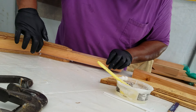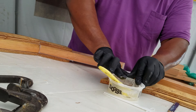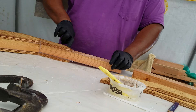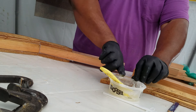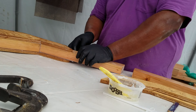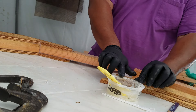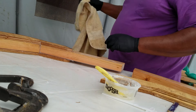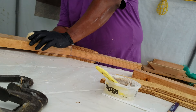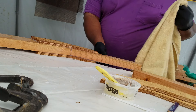It's a pretty good day here. Put a little bead in the middle — that's an important place to keep water out. Looks good. Can't touch the camera to show you the backside yet. Put an initial wipe, get all the epoxy off, then I'll take a towel and wipe it down, because I don't want any epoxy build-up on here — that's just more stuff to sand. So we'll wipe it off clean.